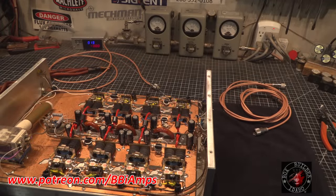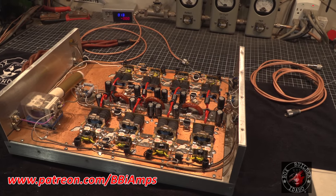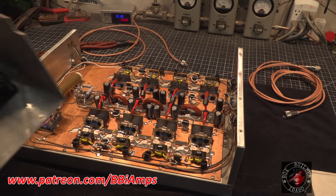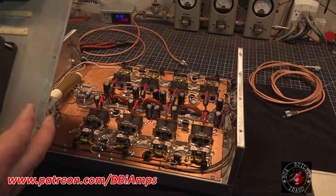As you guys know, and I'm just going over this so everybody else knows, the reason I spray just a little tiny bit of clear on everything is to help prevent corrosion. Well, in this particular environment, I'm doing it a little bit more to kind of help keep the dirt off of everything and maybe keep the solder splash from being so conductive. Maybe. I know that's a naive idea, but that is the thought. I'd like to believe that spritzing this down with a little bit of clear is going to help keep it from getting so conductive. So, just want to blow the dirt off the fans, and yeah, we'll go from there.